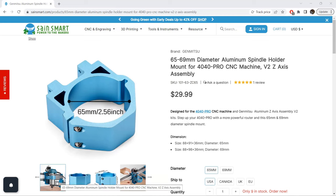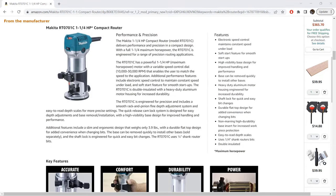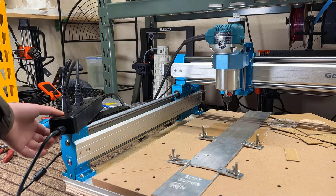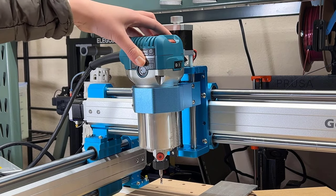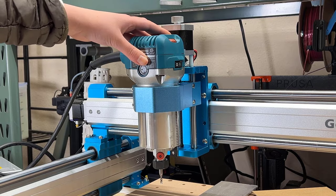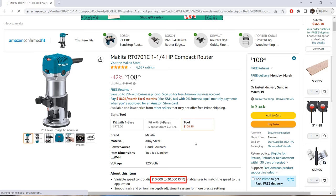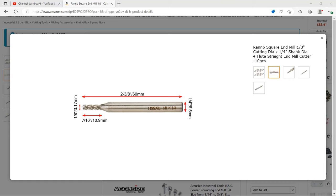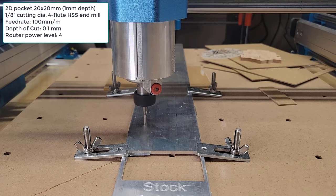After that, I will install the 65mm mount with the Makita router. The power of this router is 1.25 horsepower, which is around 800W. As it connects directly to the AC outlet, the installation is much easier than the 300W spindle kit. I connected both the machine and the router to the same power strip, so the switch can also work as an emergency stop. As the weight of the Makita router is heavier than the 300W spindle, it actually moves quite a lot when pushed. The router uses a knob to control the speed from 1 to 6, with a speed range of 10,000 to 30,000 RPM. I will start with level 4, and begin with a 4-flute 1/8 inch diameter end mill — the only small bit that fits the standard 1/4 inch shank collet — though it may not be ideal for cutting at high speeds.